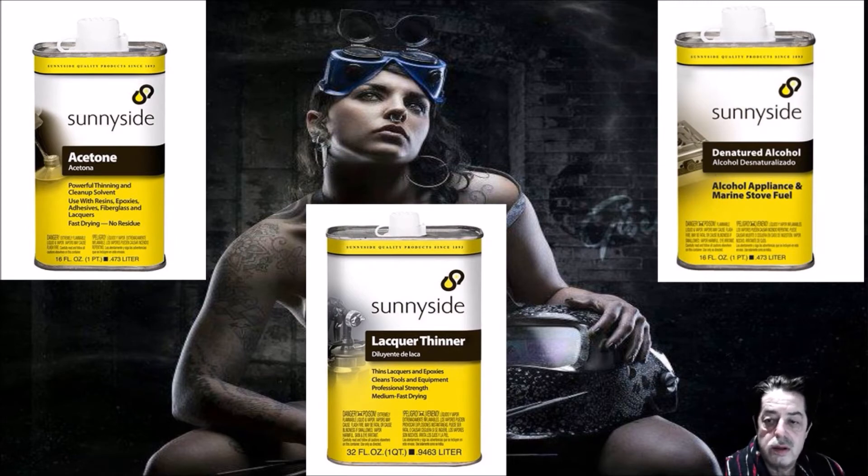Denatured alcohol is a close second. I use denatured alcohol — I've gotten away slowly from mineral spirits for woodwork, but I still use it for cleaning wood prior to any stain or finish. Denatured alcohol dries like instantly, so you just have to understand it's incredibly fast drying. Lacquer thinner — I use it a lot for cleaning my brushes. I can thin lacquer with it when I buy solvent-based lacquer, giving me more working time. It's really great for cleaning my detail sprayer and spray gun — I throw all the parts in a little Tupperware bin and clean everything up with it, and it works really, really well.